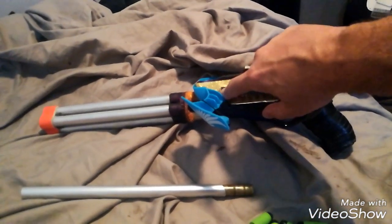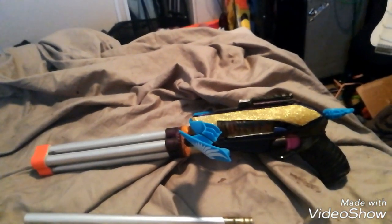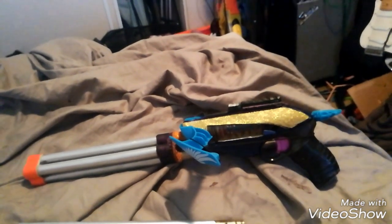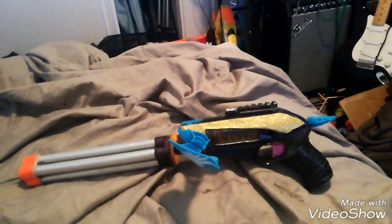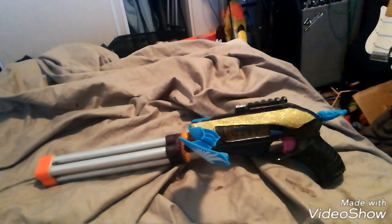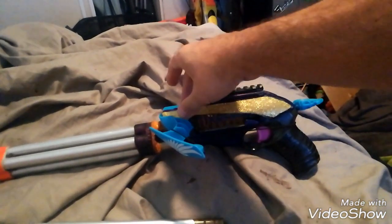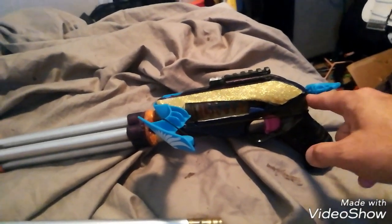Another thing you'll notice that's different is the binding. Basically, your front coupler is glued here but it's bound to this frame, and that basically holds the front of the plunger tube together. Whereas on a homemade, you usually have two or four screws. The nice thing about this is it's mechanically held in and reinforced by the fiberglass underneath. This means I don't have to worry about screw joints or cracks in my polycarb from screws. If you drill your polycarbonate good enough and don't over-tighten those screws, you're pretty good.